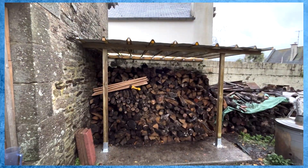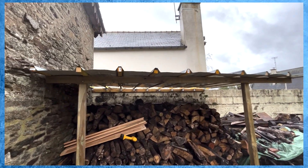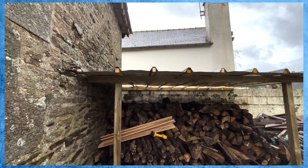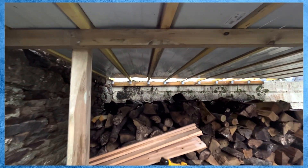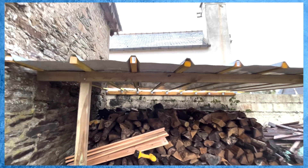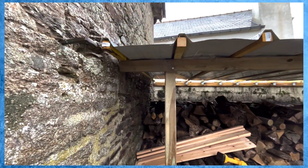The legs are on and the roof is up — it's not nailed in place yet. We had a bit of an issue because I didn't calculate how many bits of wood I needed on top, but I've sorted that now. All we've got to do is fill a gap at the back — I've got to cut a panel into three sections, put it on there, nail all the roofing on, and then tidy up the sides by putting some quarter-angle trim on.